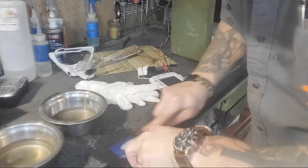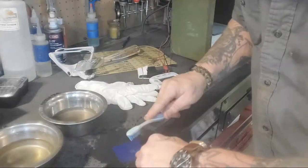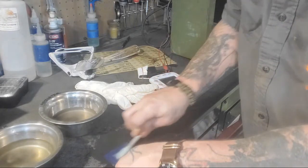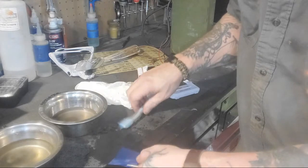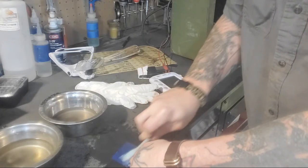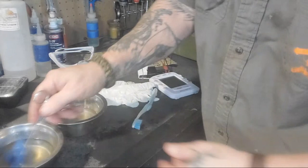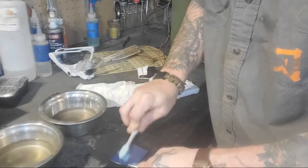What I've noticed is if I don't keep stencils in a dark place, over time the emulsion hardens and eventually cracks. Those cracks will allow your etching solution to flow through and you'll have little crack lines on your knife blade, which looks really amateur. That's the point where you want to make new stencils. Since all the variables — light box dimensions, lamp wattage, distance from the light, stencil hardness, age of material — vary greatly, I can't give you a solid time. Five-minute exposure is a good place to start; keep a notebook under your conditions.